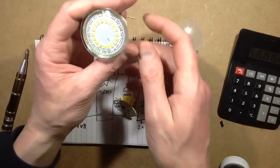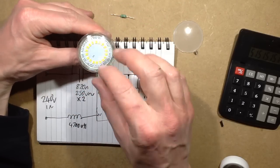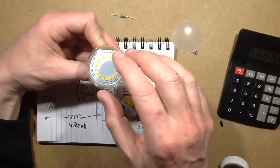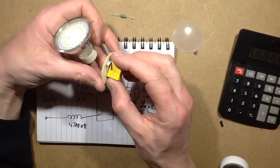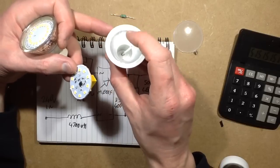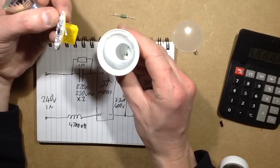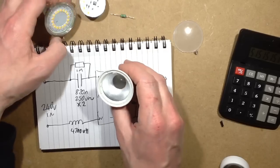This one had similar test characteristics doing the electrical test on the outside. Look at the way that it's got plated through holes that are just everywhere in this to actually take the heat through. This one is just the bare material, but it was glued well round the edge to probably couple it to a degree onto that aluminium housing. But yeah, the inside looks like it is aluminium.